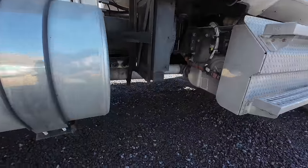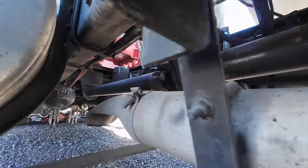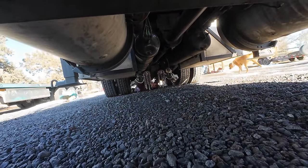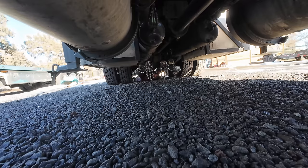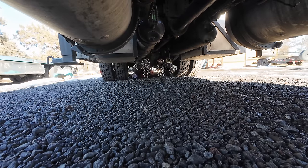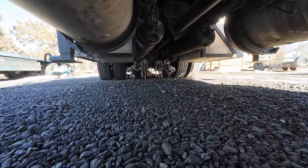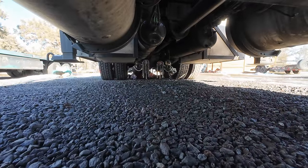Sounds good. So one thing with this super long truck is it has about a mile of driveline and carrier bearing and U-joints to get all the way back there. So he's been greasing U-joints. Yeah, I've greased that U-joint, that one, all of the OnSpot chains, which have serviceable grease ports, which is awesome. Love to see it. And then there's also all the brake fittings and all of that jazz. I've been under here for like 20 minutes, half an hour at least. It's not ideal, but we'll make it happen. Got to keep this thing moving and moving smooth.